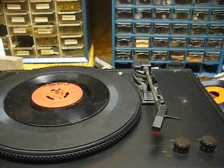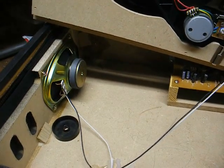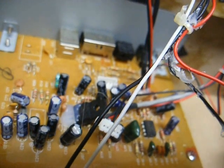Now let's open this up and see what the inside looks like. We have it open, and there's our .45 adapter as predicted. There's our cheesy little amplifier board and our cheesy little speakers. This board back here is our USB interface. You'll notice the hot glue here — it looks like they missed a spot. They even got some on that transistor, or more likely an IC, because the low-quality machine soldering would probably break loose, so they need that to hold it in place.